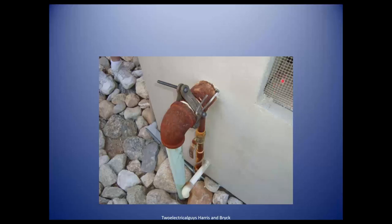This wire mesh that's a quarter inch — quarter inch is good for combustion air relief and combustion air. You need one at the top and one at the bottom of the mechanical room. You need 100 square inches of combustion air — 50 at the top and 50 at the bottom — for air relief and combustion air.